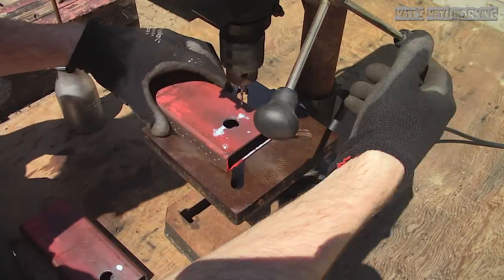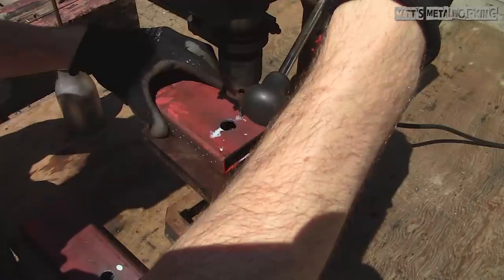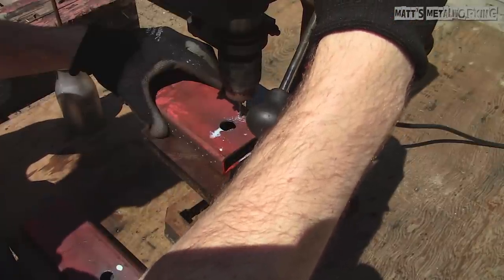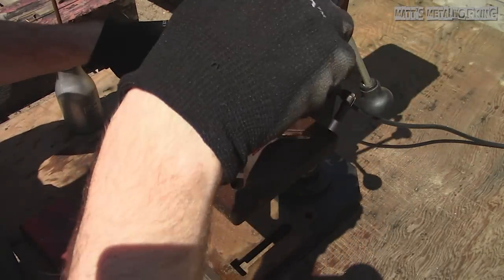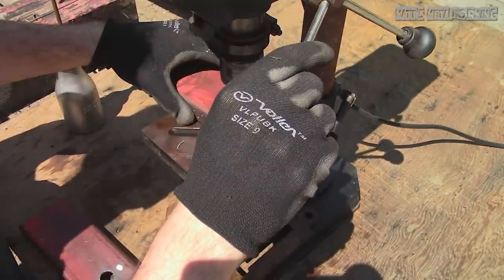Once those main holes are made I made a square center line and then marked out the holes where the feed tubes screw on, basing it off the gasket. The hole sizes are based off the self-tapping screws I'll be using. Some models of self-tapping screws can drill their own holes, however I prefer to drill a pilot hole instead — this allows for easier installation and prevents them from wandering.